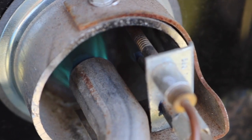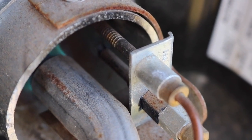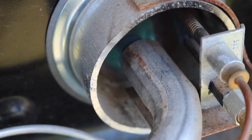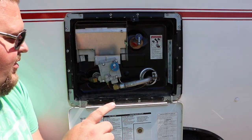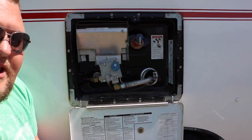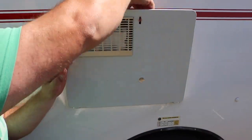You can see it's picking up the flame. The little tube I was talking about earlier is that bottom tube curved upwards — that's what's going to heat everything up. The water heater right now is going full bore. You do not need any electricity to get this going — you're only using gas and a lighter. Once you have it heated up, go ahead and close this door — it kind of protects it from the wind a little bit.